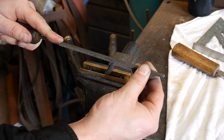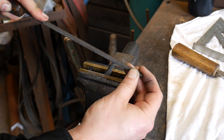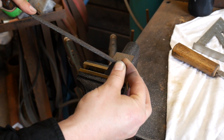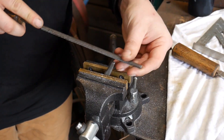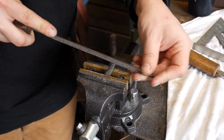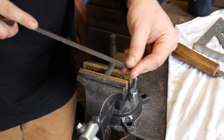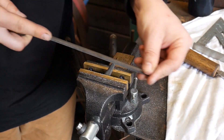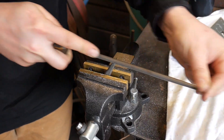We're going to go ahead and try to file straight across by digging into the tip first. You want to aim for about center if you can, and if you can get it centered up, take your time with this. Give it a little time to get that tracking just right — that's the key. You want this to end up in the center. Then slowly rock back to where you're horizontal and flat, and now you're creating your concave butcher tool.